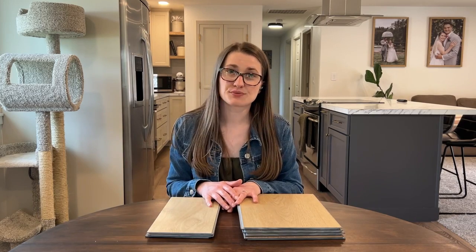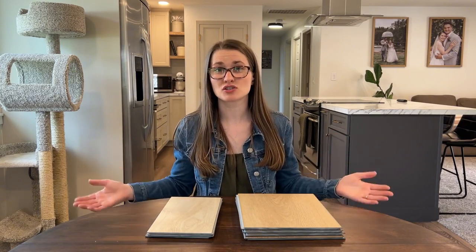I want to preface this review by saying our floors have been installed and been used for 6 months now. We installed them back in December and it is now June. Now that being said, one of the pros or advantages of Flooret's flooring, specifically the Modin collection, is that it's made from a stone polymer composite core, SPC core. That means it doesn't expand or contract as much as most luxury vinyl plank floors do.